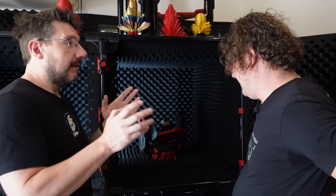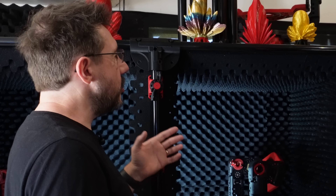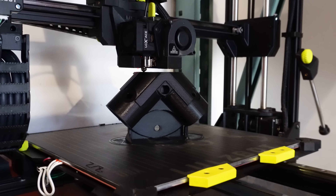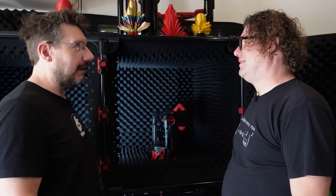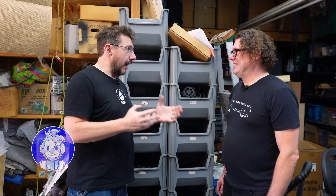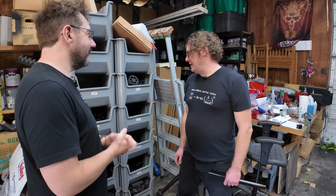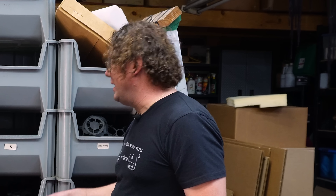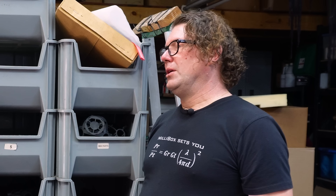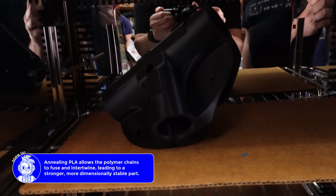Moving on — no metal allowed. What appeared to be metal is actually PVC. They do the cutting, jigs, and manufacturing right next door. This is where the 3D printed parts end up. Before assembly, the parts go into an oven for annealing. They use a special form of PLA that needs to be annealed. The print orientation is shown — annealing causes some shrinkage and compression.